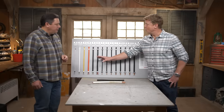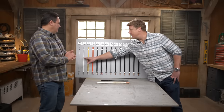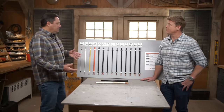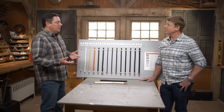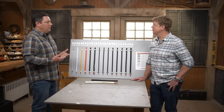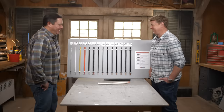So what if I start using the wrong wires? Or what if I start trying to plug things into a 14 gauge circuit that I shouldn't? What's going to happen is certain appliances use a certain amount of power. If something's really designed to be used in a kitchen or bathroom and you try to plug it into a bedroom circuit that's a little smaller, it may draw too much current, overheat the wire, or draw too much for the breaker and cause a trip. So don't bring the blender into the bedroom.